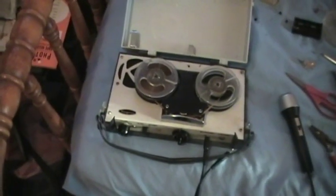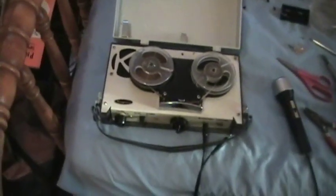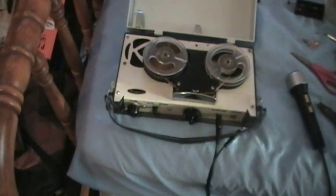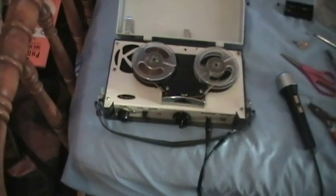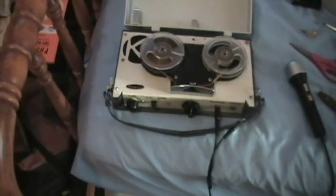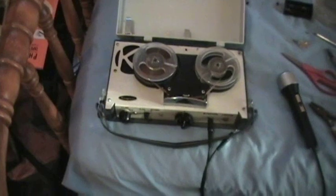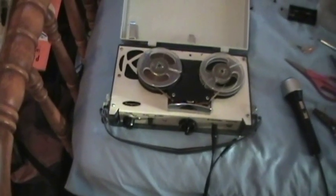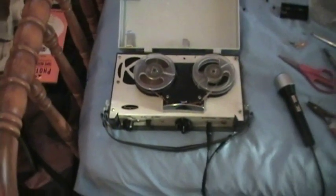As before, we had a very weak amplifier in which the sound was not very loud on playback and was even worse when it came to recording. It recorded distorted if you spoke too loud into the amplifier, even though it was weak. One capacitor was slightly leaky, but that wasn't the culprit of the amplifier's problem. It was a bad germanium transistor.